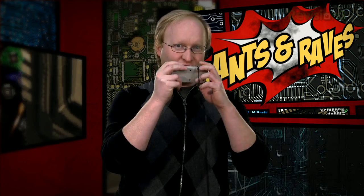My rave today is about the Nintendo Entertainment System — it's truly one of the most classic consoles there ever was, and it single-handedly revived the video game industry. While its CPU is nearly identical to older Atari systems, it had much improved graphics thanks to a separate processor and character RAM. Developers could also put hardware in the cartridges, allowing for larger and more advanced games — something you can't do nowadays with a disc. I do have some rants though: the square controllers dented your fingers during play sessions, and the lockout chip was a pain. Since then, Nintendo consoles have all had weird limitations — the Super Nintendo speed, the N64 texture buffer, the GameCube's mini discs — but still a very important part of gaming history.